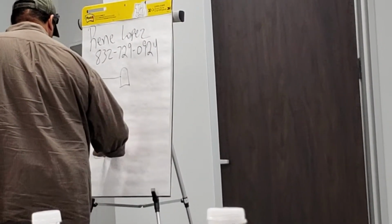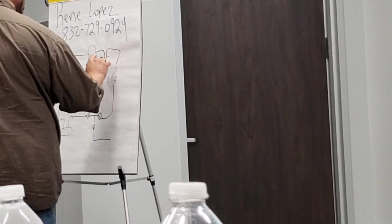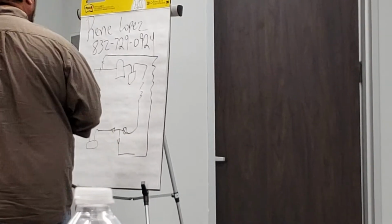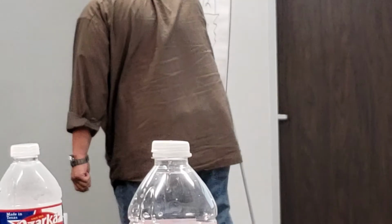Compressor, you're going to go down, condenser, receiver tank. Heating device. Accumulator if you need it. So what you've got now is you've got a valve. The older style, you had a valve there, had a valve here. So hot gas reheat, so this is your condenser, this is your evap, receiver, accumulator. So instead of sending the discharge gas to the condenser, you're actually sending it over here to a coil.